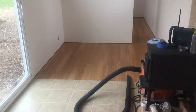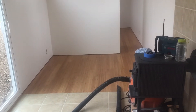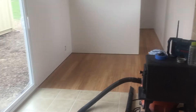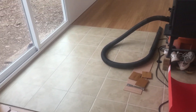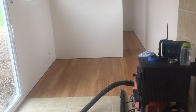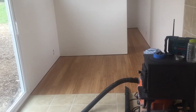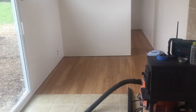When you're installing hardwood flooring like this, you always want to make sure your wood is acclimated to the surroundings it's going to go in. In this particular case, the wood has been staying here in the container — as you can see there's a pile there — for about three days or so. That helps it adjust to the temperatures in your living space. Right now in this shipping container it's pretty hot, even though it's not even summertime yet.